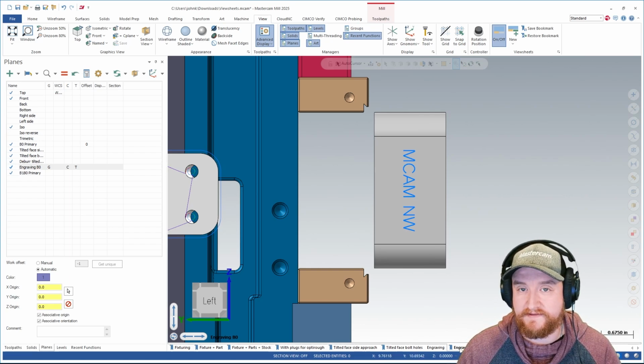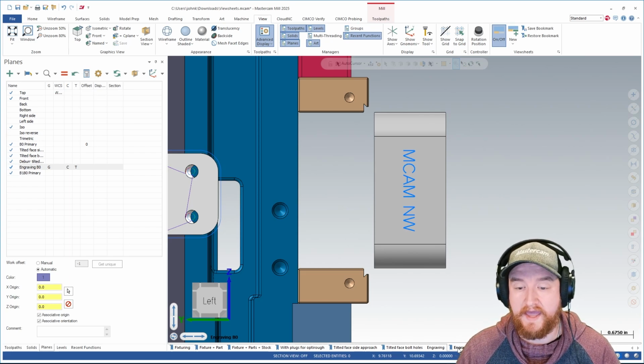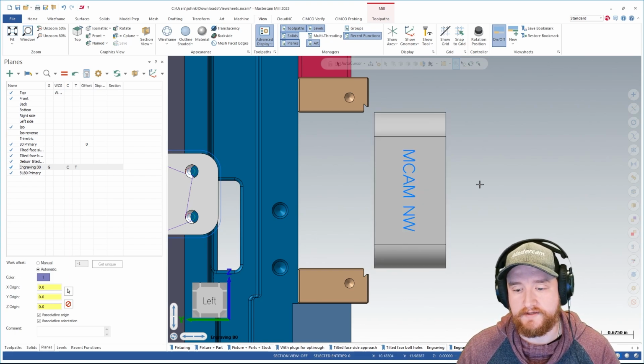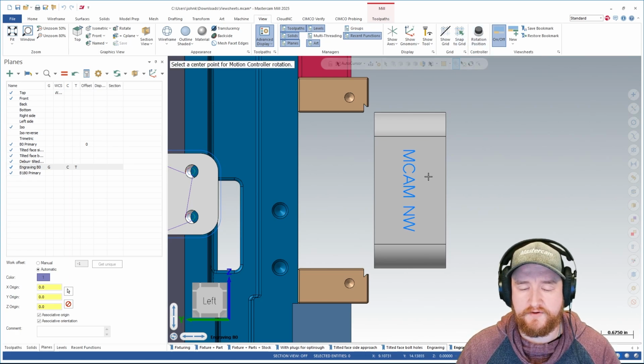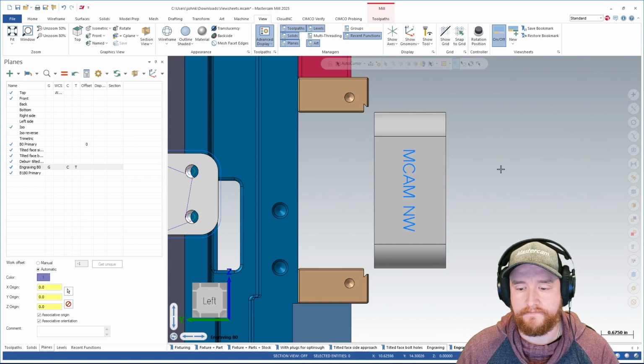And remember, there's lots of settings that you can save with this. There's actually one that I forgot to add in earlier, so let's add it now. You can update your view sheets after you make them. One other change I want to make is making my rotation position at the center of this face when I'm in this view sheet. So I can go to my View tab and click this button for rotation position, and then I'm going to set this at the center of this face using F on my keyboard and then clicking.